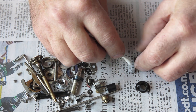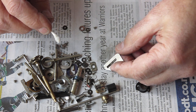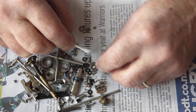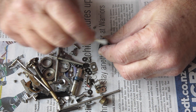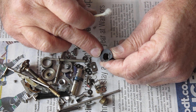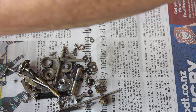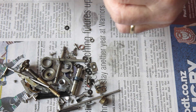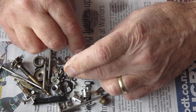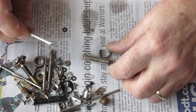I'm dealing here with the strap lugs and the hold-down plate for the cocking rack, plus the bush that goes under the rewind knob and the bush for the rewind shaft. Quite commonly that will be filled with dirty old grease and grit, but this one is quite clean — probably because someone serviced the camera before and didn't bother to lubricate it afterwards. So with no grease, it hasn't taken up any dust or grit.